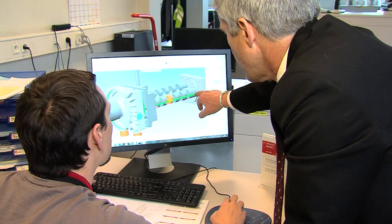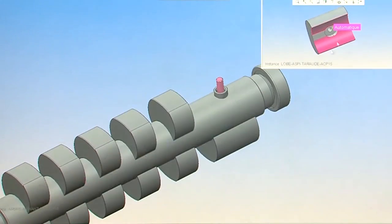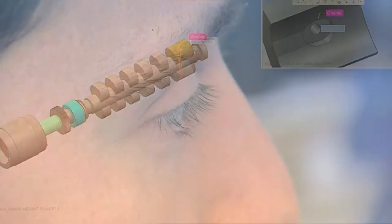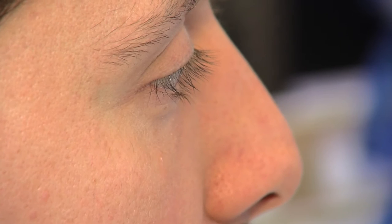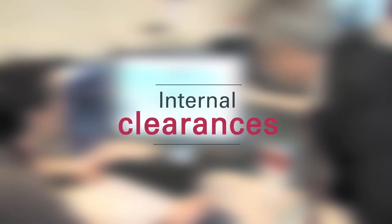The dry multi-stage ROOTS consists of several ROOTS lobes positioned on two parallel shafts. In order to achieve the required performance and reliability for a broad field of applications, Pfeiffer Vacuum experts can vary several different parameters at the design stage: rotational speed, size of ROOTS stages, number of ROOTS stages, internal clearances, inert gas injection, and type of material.